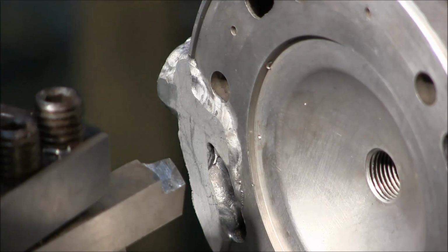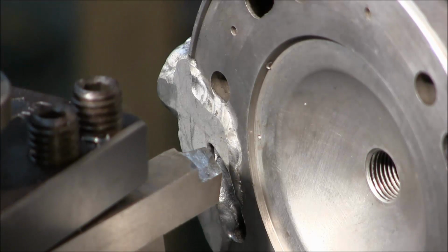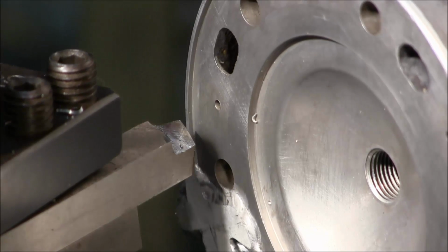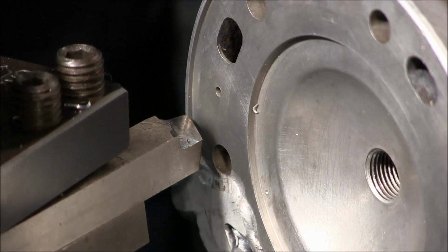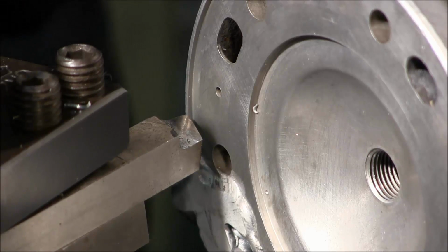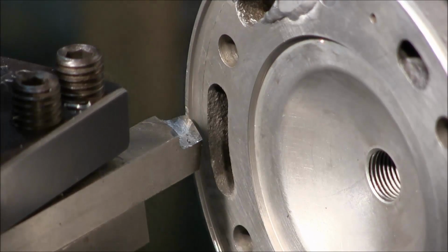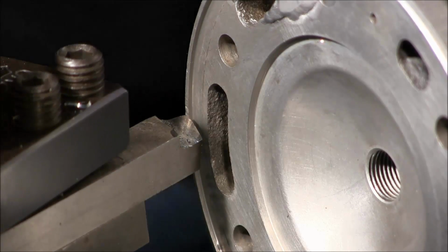All right. A miss is as good as a mile right now because I'm just going to be going in about a 1/16 of an inch here. Now I'm just coming over here and I'm just going to eyeball the diameter that I want it to be for right now, and then I'm going to go ahead and scribe a line there. Actually, I'm just going to go ahead and paint a little Sharpie here.